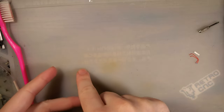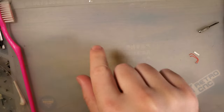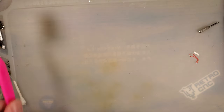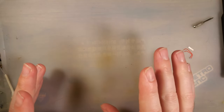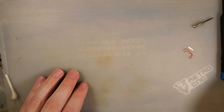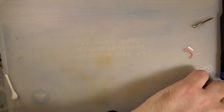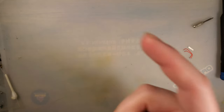The left Joy-Con, the process is identical, but the fuse is in a different location. I will go ahead and throw a link to my Reddit thread where you can read through that conversation where someone insisted that they were zero ohm resistors, and I insisted that they were fuses, and they insisted I was wrong, and they offered no explanation. Anyway, in that thread is my research on both Joy-Cons. It shows the location of the fuse in the left Joy-Con if you want to replace that.